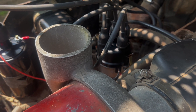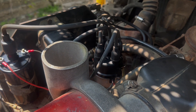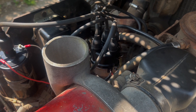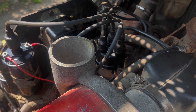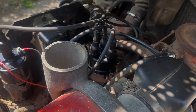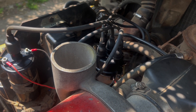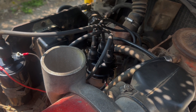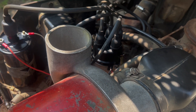Then start up the machine — more than likely it won't start. Just hold the ignition and keep the starter going until you hear some spark. In my case I had to rotate it close to 180 degrees. I was initially only rotating about 15 degrees either side and the machine wasn't starting. So if you're having problems, rotate a complete 360 degrees until it starts. Once I got spark, I set it in the middle where the machine ran best — I'd turn it to one extreme and the cylinders would slow down, then the other extreme and they'd slow down again — and I tightened down that bolt with the 9/16 socket.